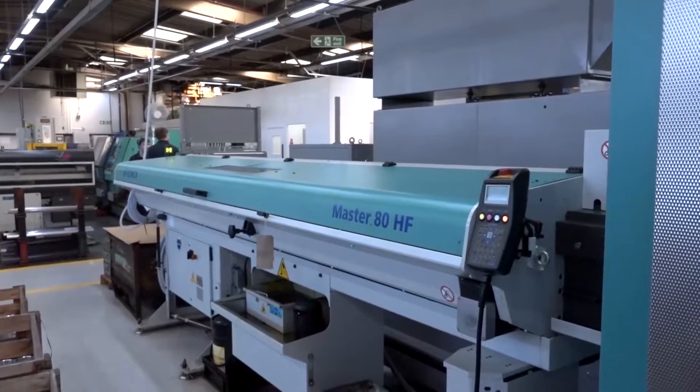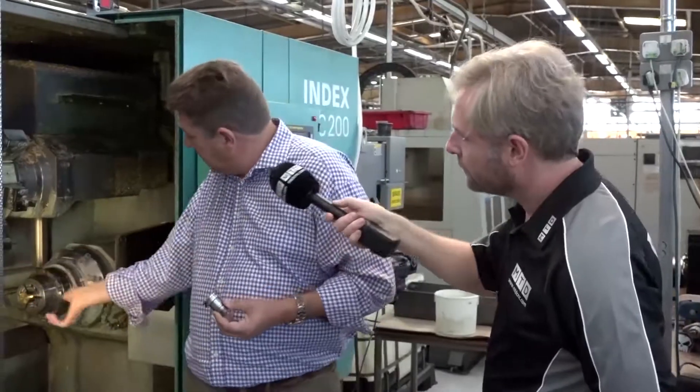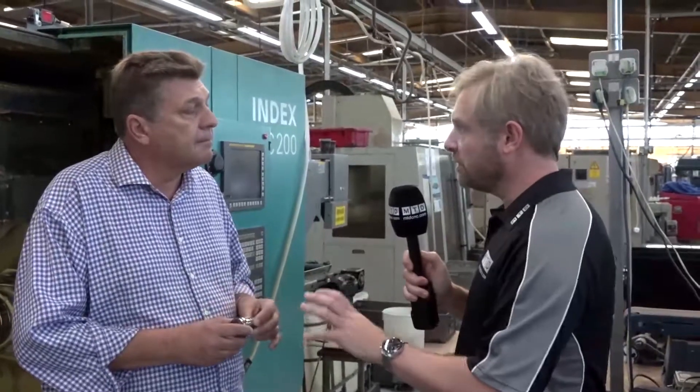That gives you flexibility and efficiency because you've got the three meter bar feed. Once it's set and running we can check sizes on the machine while it's running, so it's an extremely productive machine. The parts are parted off and picked up by the parts catcher inside, which puts the part on the conveyor belt. The conveyor belt comes out the back — it's all rubber so it's insulated and won't mark the part — and then we take the part off, clean it, measure it, and it's done.